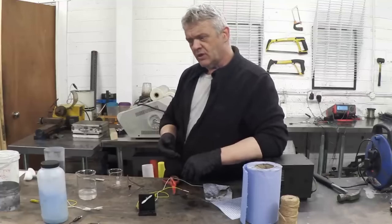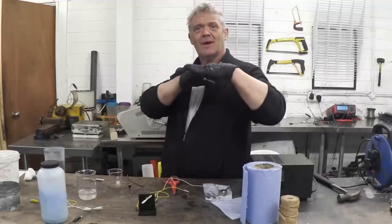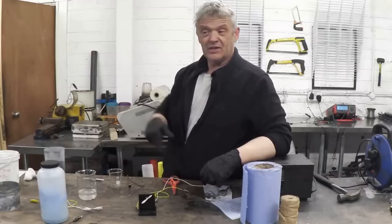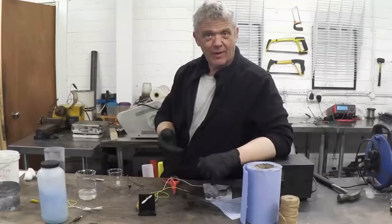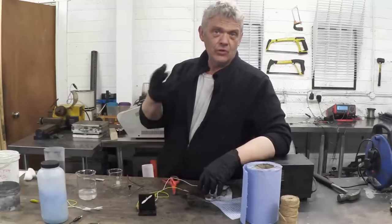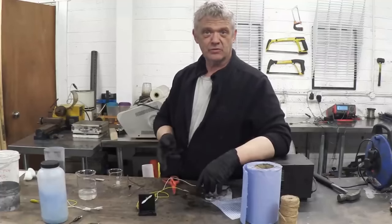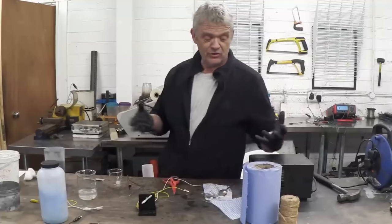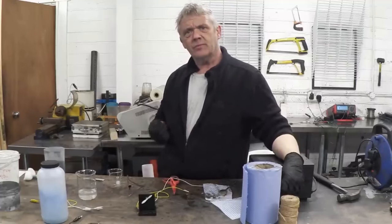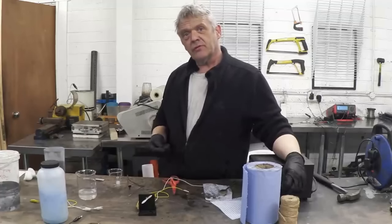And when we did it, we did a gravity battery where we used the specific gravity of the two materials to create boundary layers. And that kept things separate. And we morphed that into the halide gravity battery where we used the same principle to keep the halogen and the electrolytes separate from each other by having those boundary layers relying on the difference in specific gravity, which is what a gravity battery does. So Daniel cells' gravity batteries were extremely popular, and like today, everybody was looking for improvements.